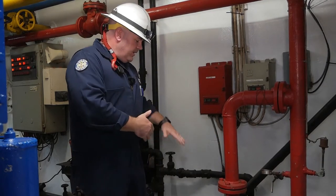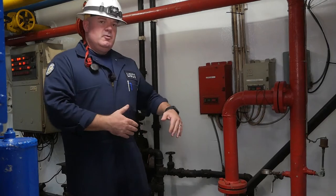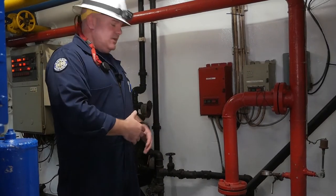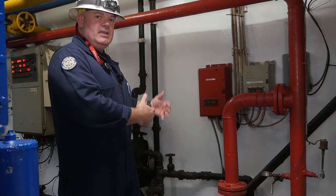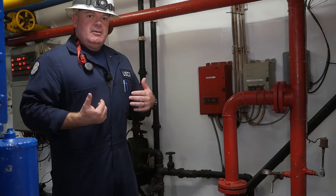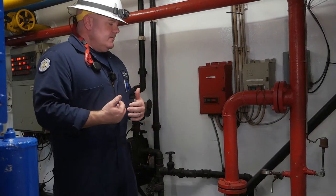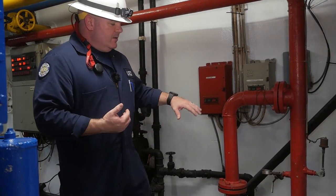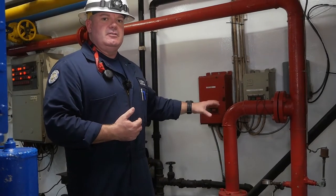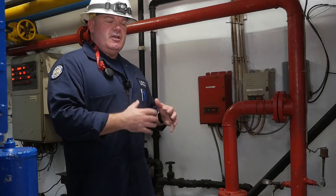You want to check your fire pump itself when it's not running — make sure everything looks intact. Make sure your electrical connections look good and that when it energizes, it's not going to arc or spark or become a hazard. Make sure all the piping on and around it is intact with no obvious cracks, damage, or any repairs that have been covered up.